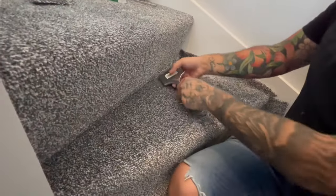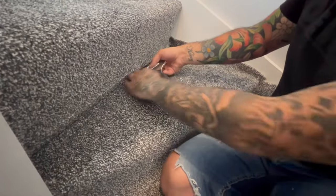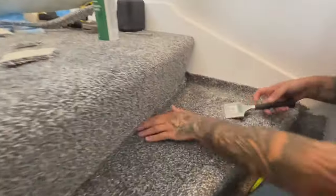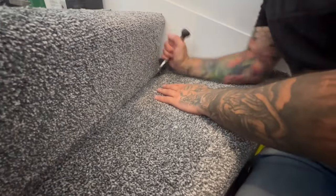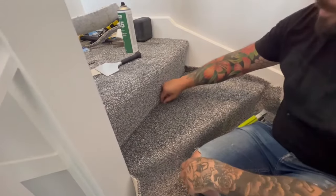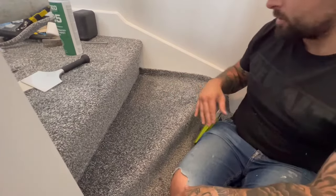Scrub away from the center — what we call scrubbing is just bending those pins over. You can hear it. Those pins are scrubbing flat, which hooks the carpet permanently, pulls the pin over onto it. Then go back the other way. So all we've done is trimmed it down, locked the back on, and now we're ready to come over the top.